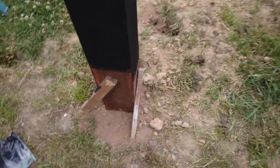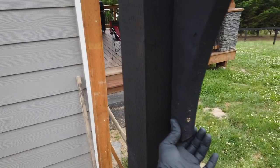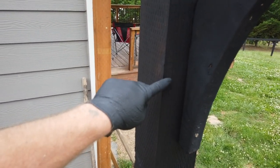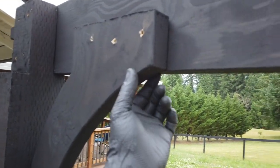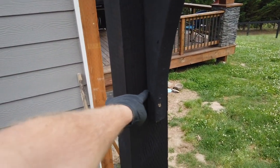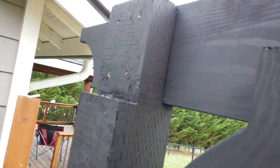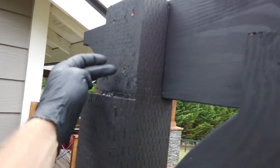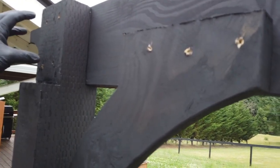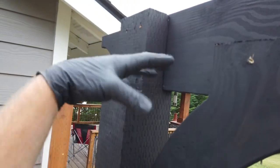Yesterday I set the posts in fast-setting concrete. I dug the holes down about two feet deep. With these arch pieces that we cut out, I stained these — they're still a little bit wet — but they go up and I put mine in like this. Here's how the notch came out. I stained all of this just in case any water gets back in there, to help slow down the rot. I screwed through this side into this board so you don't see anything on the other side. I might even put a black bolt through to keep everything together so it doesn't warp, twist, and pull the screws out.